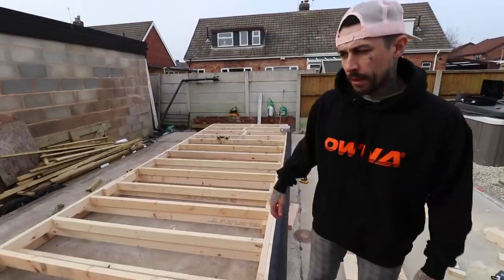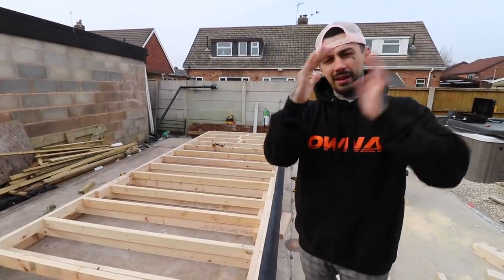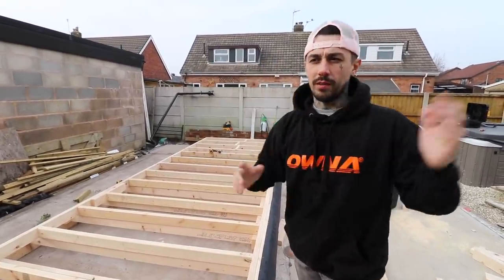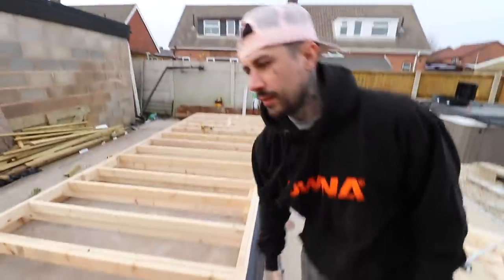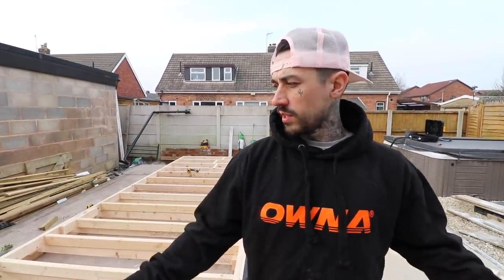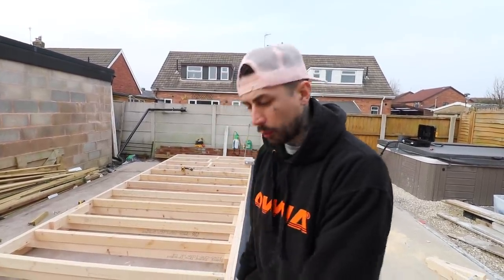So this is my back wall, which I've begun putting noggins in for stability. Then I'll put them all in the side walls, and then we'll load the joists, which are those bad boys over there. I'm putting my damp proof membrane on the bottom, even though I shouldn't need it, because both concrete bases are damp proofed underneath them, and the wood, the battens and the cladding are off the edge of the concrete slab, and then my cladding's going to close the slab and go down the side. So I shouldn't need these, but we're going to put them on anyway.